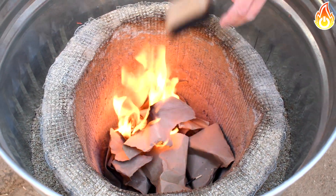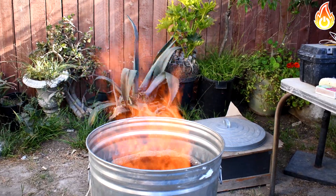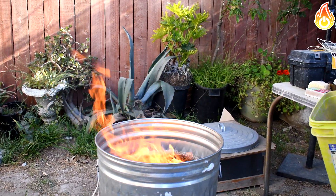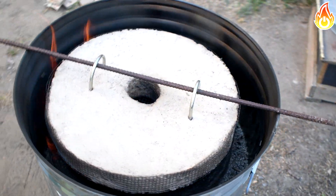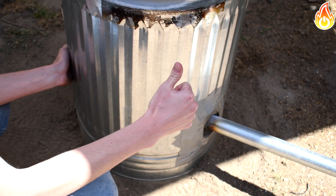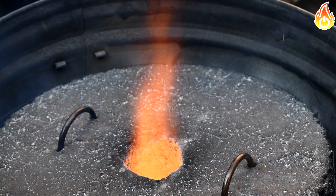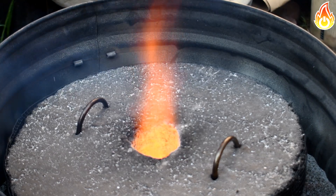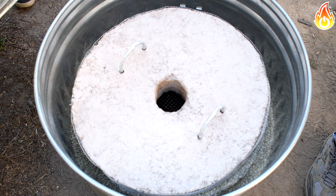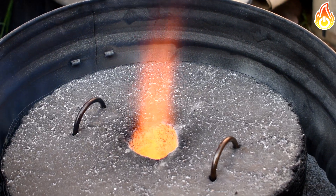For the first burn, I added some scrap wood and slowly increased the temperature to help dry out and start curing the furnace. Since we used clay, it needs time to fully turn into ceramic, but with each firing it should get stronger. The insulation is working very well — right now it's about 2,000 degrees inside the furnace and I can touch the body with no problem, it barely feels warm. It's mind-blowing that only four inches of material keeps my hands safe from that heat. I made the furnace just tall enough to allow the original steel trash can lid to go on top, but don't put it back on right after a melt — wait about a day for it to cool down.